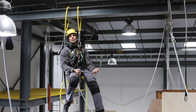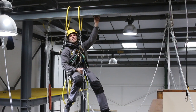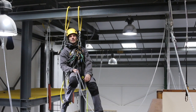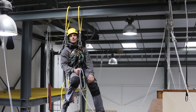What I'm going to demonstrate here is one version of retrieval rigging or pull-throughs. We're going to do it on this I-beam — it doesn't have super sharp edges, but it's got enough of an edge that we're going to use wire slings in the system to protect our ropes. I'm going to demonstrate two ropes; there are other ways of doing it, but if you use two different coloured ropes it's a lot more obvious what's going on.